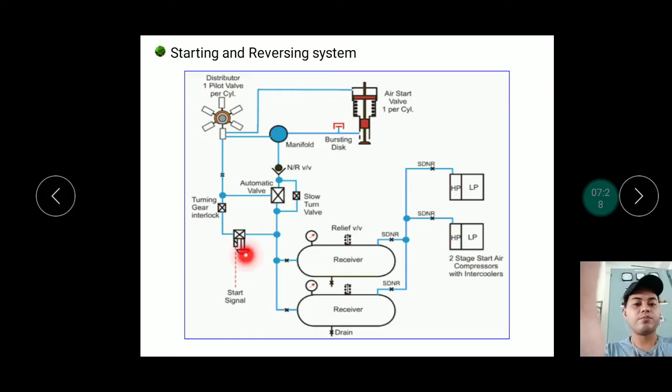When you press the push button to start, first disengage the turning gear to remove the interlock. When the turning gear is disengaged, the interlock valve opens and stays open. With this valve open, you can press the start signal. If the valve is still closed, the start signal will fail — an alarm or failure indication will show in the engine control room indicating that the turning gear interlock is still active. There are many other interlocks in the starting system, but this covers the basic one.